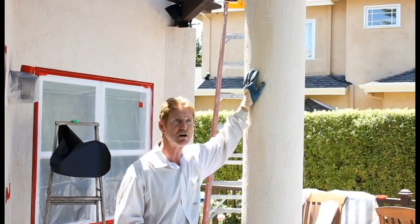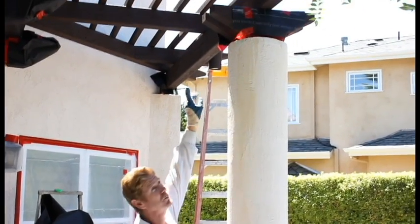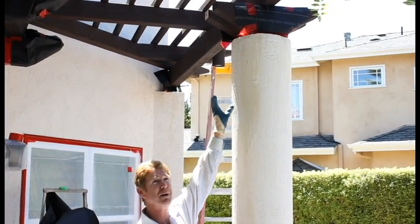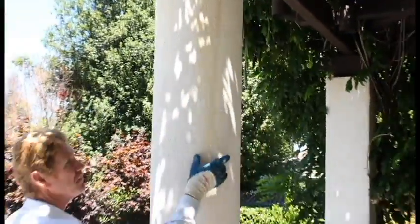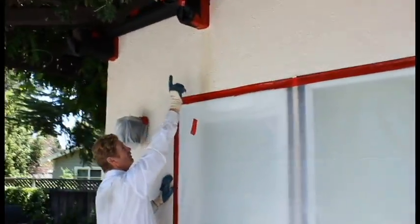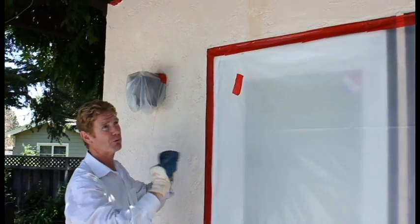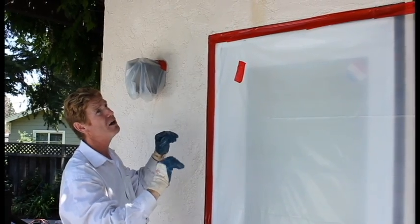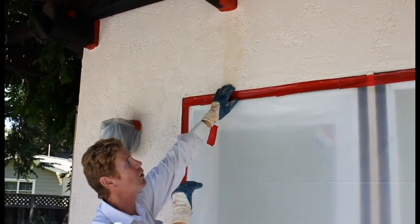What is the answer is a fog coat. A fog coat will get this out. See the staining here? That's where the wood, before it was primed and painted, bled. Can you see that staining right here? It's on a few of these pillars. These corbels bled — not all of them, but a few of them did where they put the plank and rubbed all the paint raw because the house had to have scaffolding.